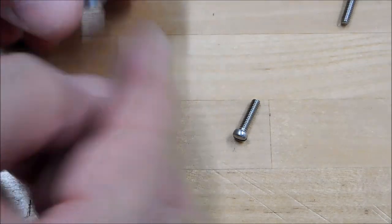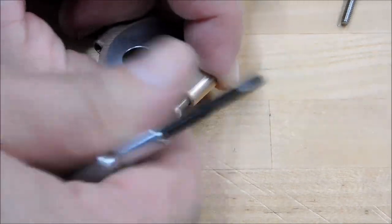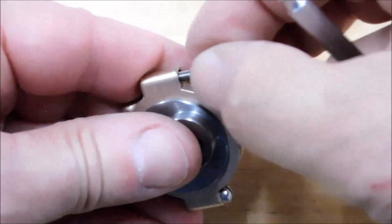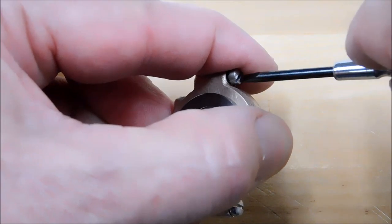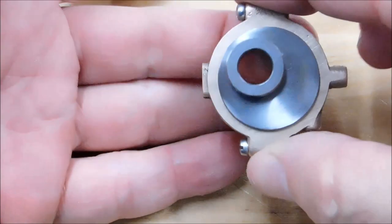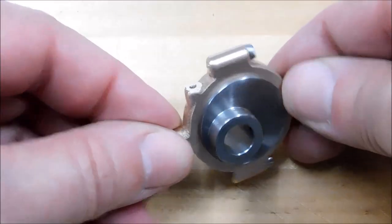Looks like the picture. Try doing this looking through a viewfinder. Now, there's really no reason to be gingerly approaching this, torquing this down. It's either right or it's not. If it's good, it doesn't matter which side gets torqued first. Make sure they are on the same plane. Press them both to one side of the cam. Oh, that's a beautiful thing right there. I like it. We are definitely getting close. Let's go grab an oil cup and see what that looks like assembled.